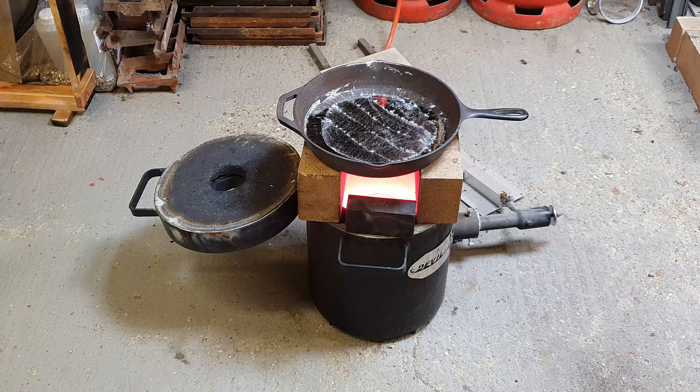If you know your zinc is pure, you're absolutely fine. You can melt it, do what you want with it — you don't need to wear a mask. It's totally, totally safe. But it's the impure zinc you want to be careful of. And obviously as soon as you go over 900 degrees, that's when you're going to get the white smoke, and that's obviously where you get metal fume fever.